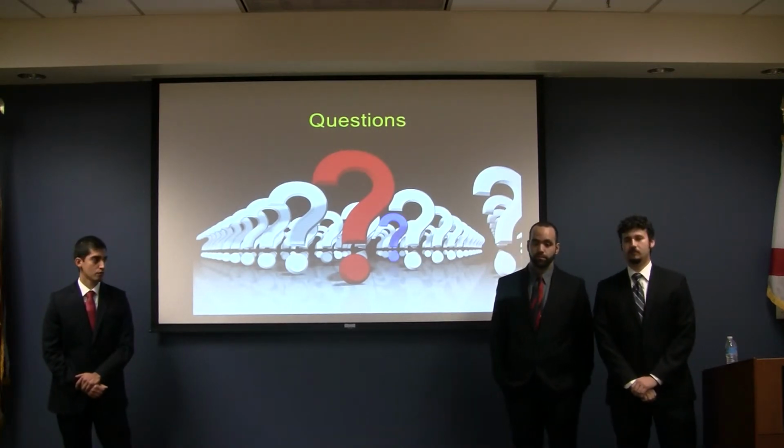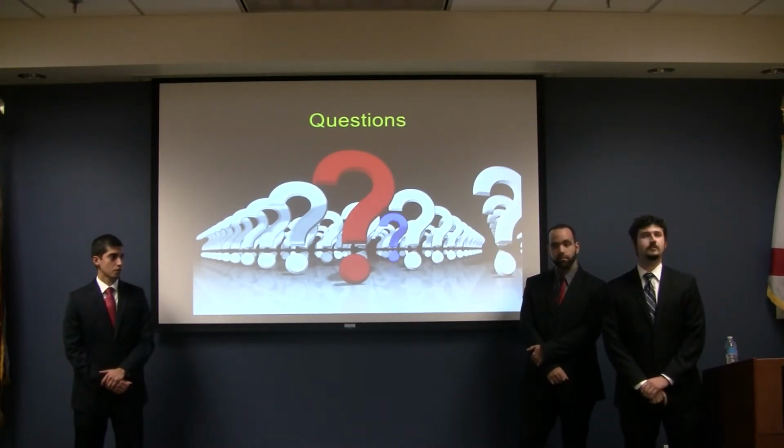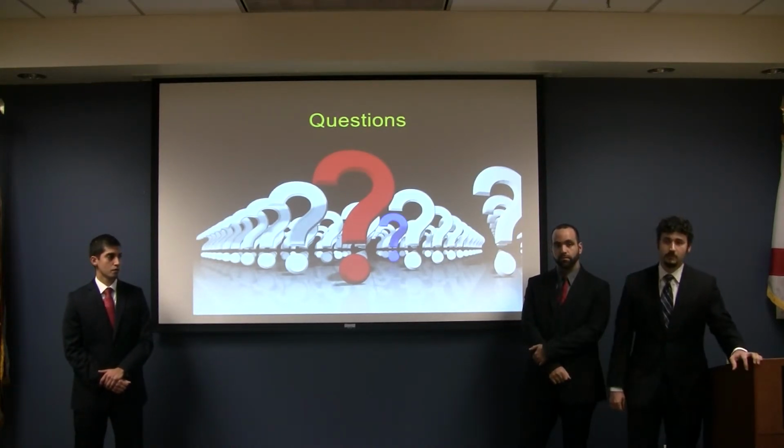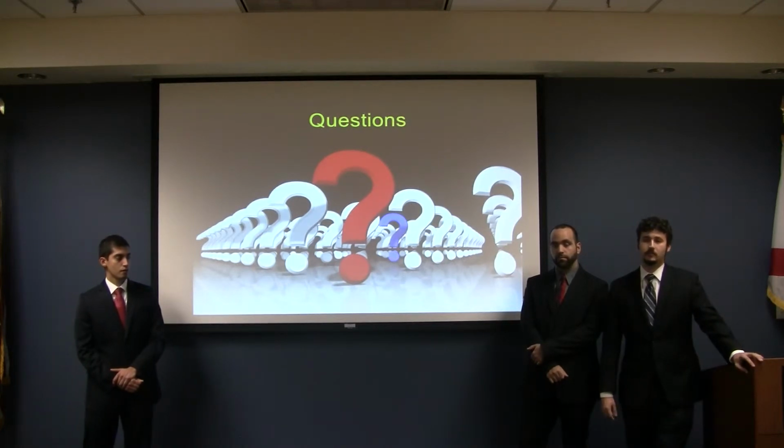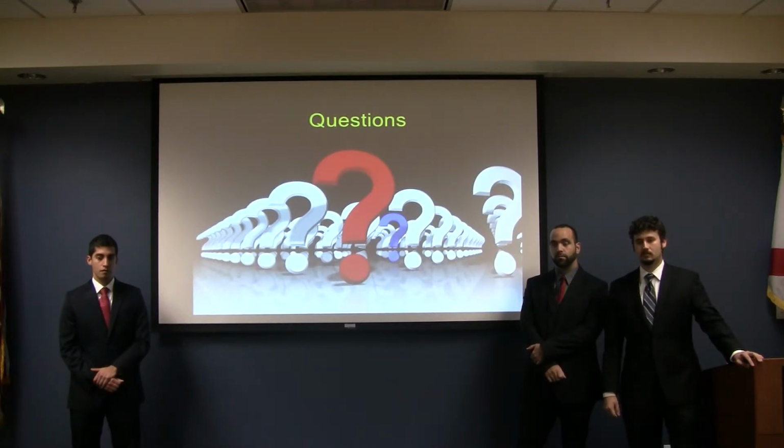We calculated the outlet volume flow based on the power output of the engine at peak, or the engine speed at peak output, and the displacement. And we used that as the outlet boundary condition, and we used a pressure of ambient, 101.25 kilopascals at 300K at the inlet. Okay, and was there any boundary conditions associated with the materials or the surfaces of the?